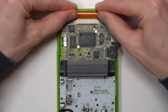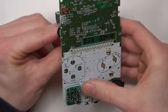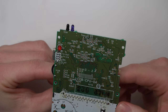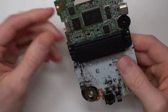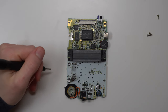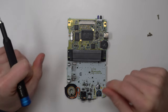The screen and buttons didn't stick to the board, which is a good sign — not much dirt left behind. There's a little bit around the start buttons but all the contacts are clean. This is a really, really good condition board — near perfection — but obviously there must be some issue stopping this from booting on. What we've got to do now is determine what part of the board is preventing the console from turning on. I'd recommend looking at the schematics — there'll be a link in the description.